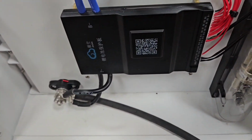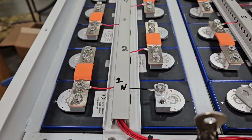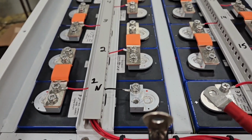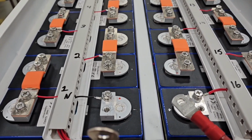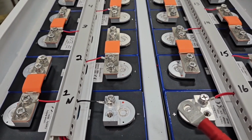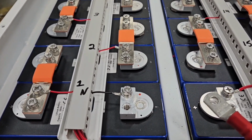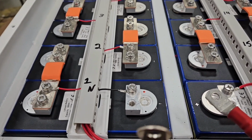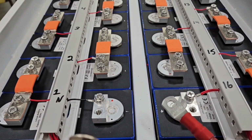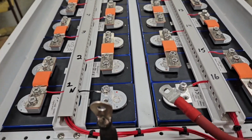I really like that. So I don't heat shrink my terminals. I did on my house one, but on these I decided I wasn't gonna. Yeah, you know, it's a mixed bag, but usually if you start seeing problems on cell voltage, you're gonna start looking anyway. And like I say, I want to be able to see if I got corrosion there rather than screw around and cut the heat shrink off and this and that. I do have a printer for printing heat shrink tubing, and I could have slipped on like I did in my house, and I'll show that someday in a video. But for this one, nah, I just said I'm doing it simple, easy way, the way most people would do it. So anyway, I'm going to get my faceplate on here and keep moving on.